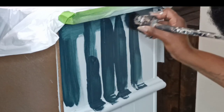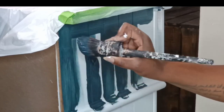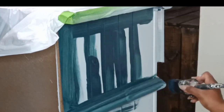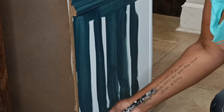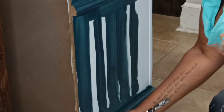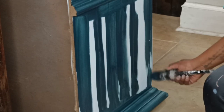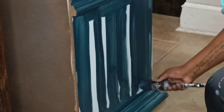Some of you may wonder why I am not using my spray gun for this. Honestly, I wish I had, but I have not gotten the settings correct to apply paint. I've tried it before and it came out really terribly, and I know what kind of result to expect when I hand paint. I want to work with my gun some more before I can feel comfortable getting a nice smooth result using that. I have found it very useful for primers as well as for top coats, so I continue to use it for that — I just don't trust it with the paint at this point. But I know it's operator error because I really do like this spray gun.